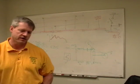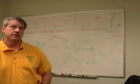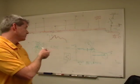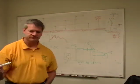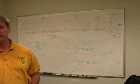What you pay for there is the indium tin oxide. Tin oxide is fairly transparent to visible light, but it has a relatively high capacitance, and you had to change your process to be able to lay down tin oxide at this level instead of up on a metal layer somewhere. So it's a process change, and that's expensive. And it's also got a fairly high capacitance, or I'm sorry, a fairly high resistance.